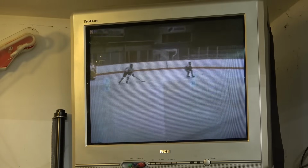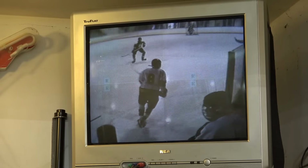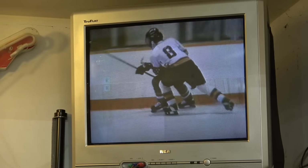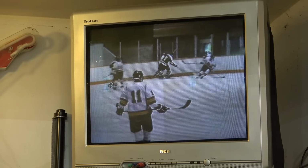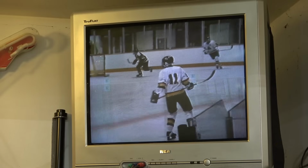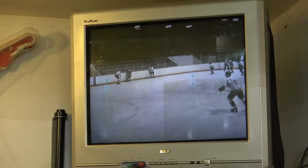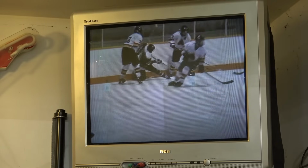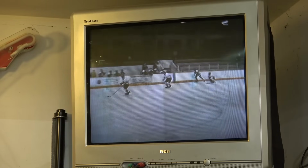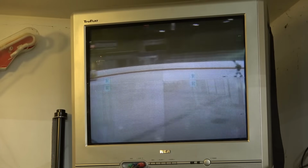But this would have sat in the boardroom, and if a tape came in that was 3/4 from, say, Vancouver cable systems, they would use this machine to dub it to 1-inch before they broadcast. But again, very, very few hours, and I serviced it a number of years ago, lubricated the mechanism that was sticking. Looks like I've got a belt that's slipping a bit now. Don't know that I'm going to have one. It's a big belt, but we'll see whether I can make it work.